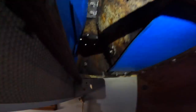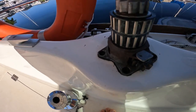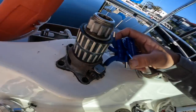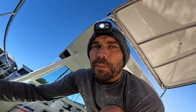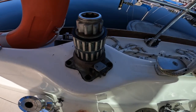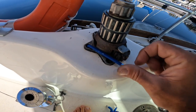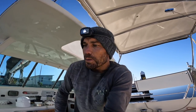I'm going to have to give all this a real good lick with some oil — you know, the kind you spray on that kills everything. I always find if I've got the choice, I'll put an Allen key style nut on the top side of the deck, because I want to make everything easy for one person. If I've got an Allen key on the top, it normally has something to push up against when you're underneath with your spanner undoing it. That's my little hot tip for people working by themselves.